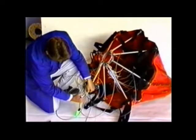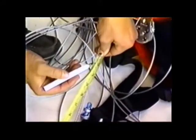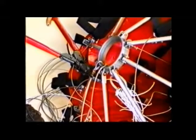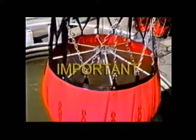Now, cut 13 inches or 330 millimeters off the IDS deployment cable. Install a new thimble and sleeve and swage the IDS deployment cable securely around the thimble.